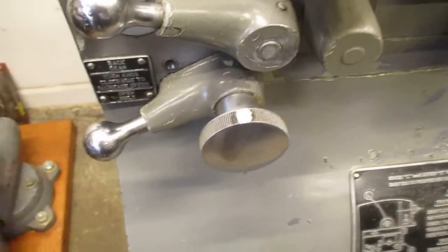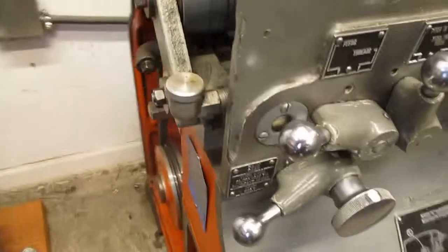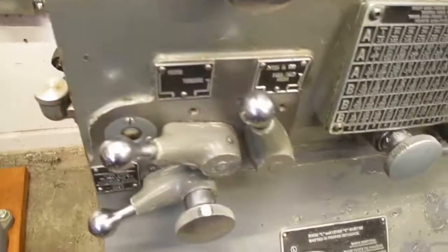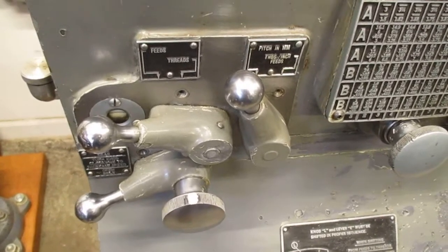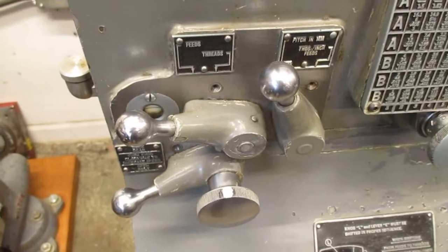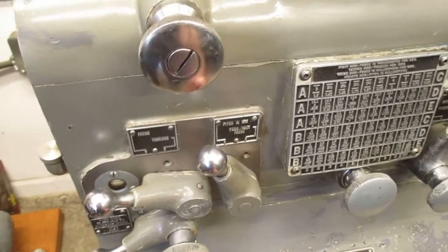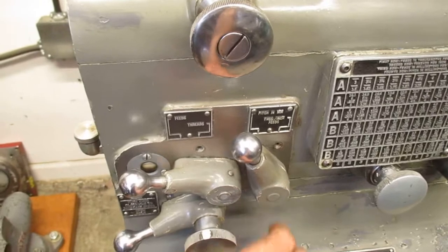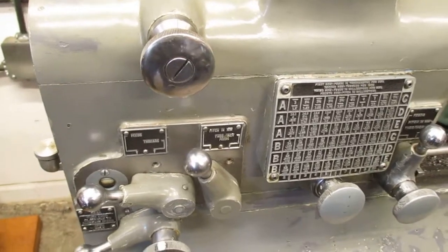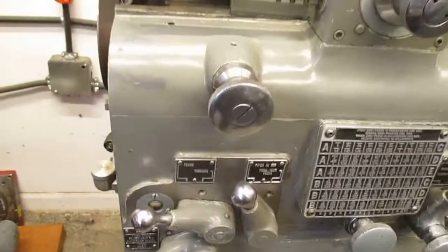At 600, the machine starts really smoothly, and it doesn't squeal the belts, because I have them loose for running at full speed. Okay, so if I'm running the machine full speed, I'll shut the spindle down at the end of the cut. Then I reach over here, it'll be all the way over here, and I can just turn it right there. I can look, okay, it's at start speed. And then once it's started, I ramp it up, okay?